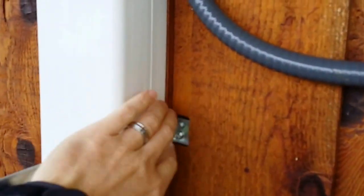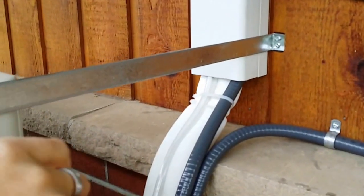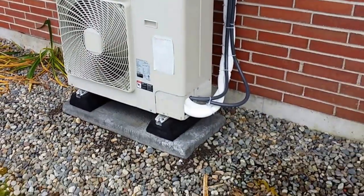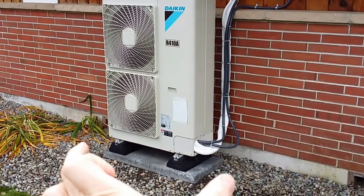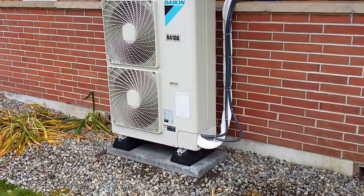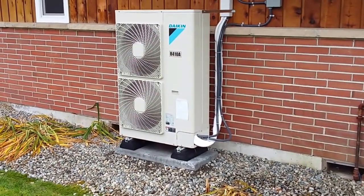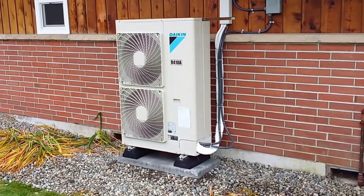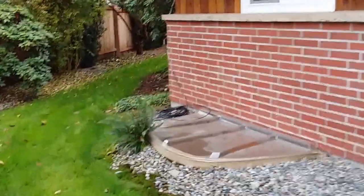There's that rumble sound. We're using earthquake straps and isolators, but not the thickest isolators available. I tried thicker isolators at my house and it didn't solve it. The bathroom mirror on the back is catching some resonance. What we're thinking of doing is putting in ground screws — like you do for a dog run or to tie a trampoline — and running a strap over the unit. If any of you HVAC folks have a better solution for getting these stuck to the ground without strapping it to the house, please let me know in the comments.